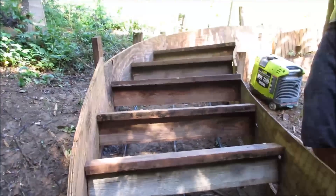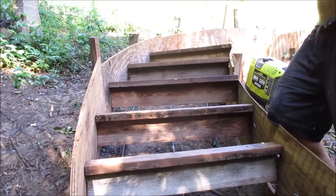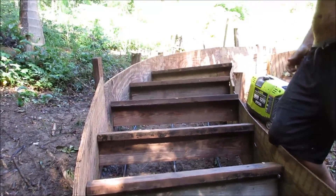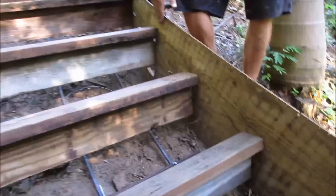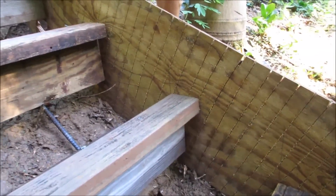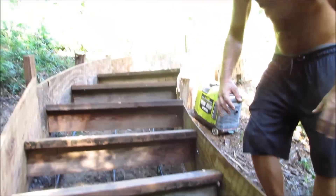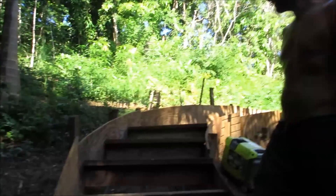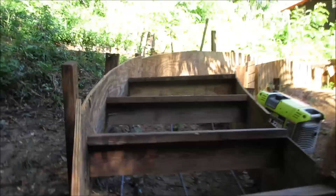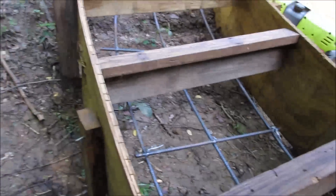For the curving, just maintain your width and get a panel that you can bend. On these panels we actually notched them on the inside with a saw so that we could bend them a little easier. These panels were just left over, and that way we can bend them. You can also wet them down and that'll help them give a little bit of flex. Just make sure your forms are very strong.